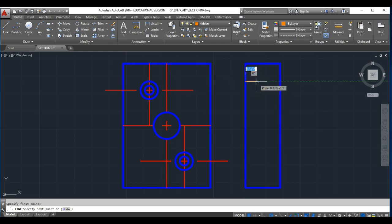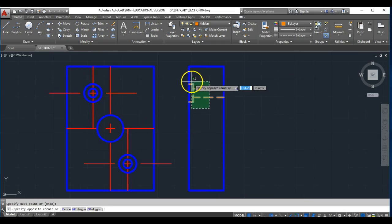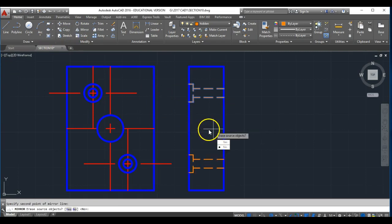Now, like I said, it only goes in 1/8 of an inch. I go down for the diameter, which is 1/2 inch. Back out. And then the smaller hole will start here and go the rest of the way through. It's not inside of here because the hole's already bigger than that diameter. So you can't have a smaller hole occupy the same space as a bigger hole. This one is going to be the same as that one. So this time I'm going to use mirror, plop it down, bring the hidden lines for this circle.